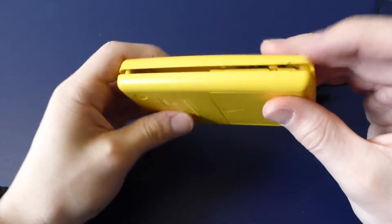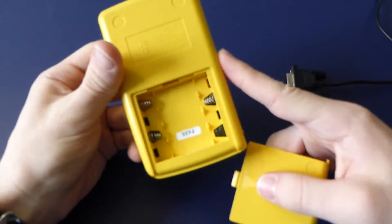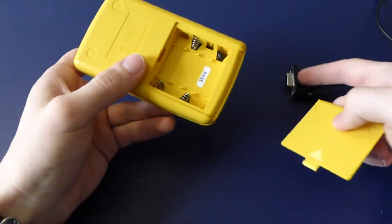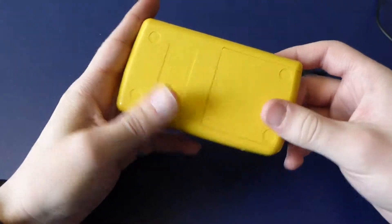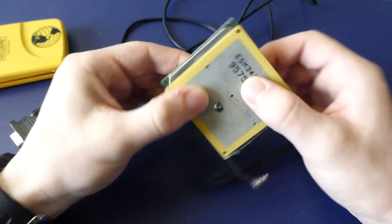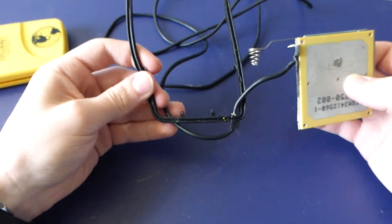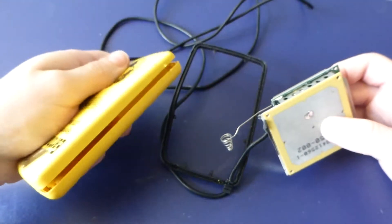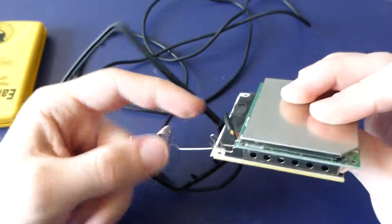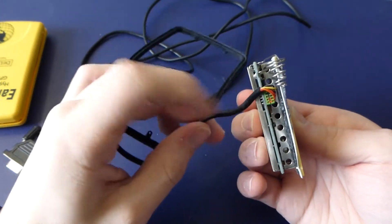There's just a rubber bead that covered this gap, and the cable comes out there. This thing is powered by four AAA batteries — obviously you can't pull that much power off the serial port. Here's the inside: it was all soldered together and I had to go through a lengthy process of desoldering the cans. This is the rubber gasket with the cable going through it, battery contacts here for negative and positive, and the serial cable goes into this little non-removable header block.